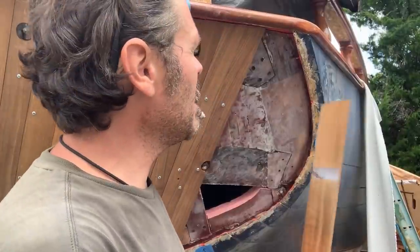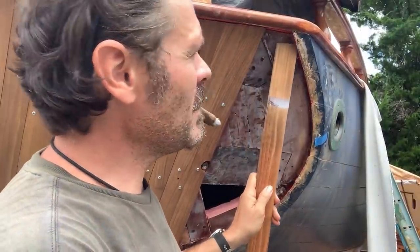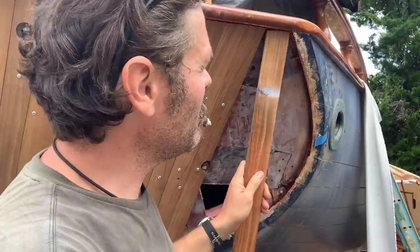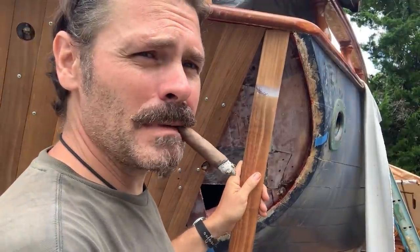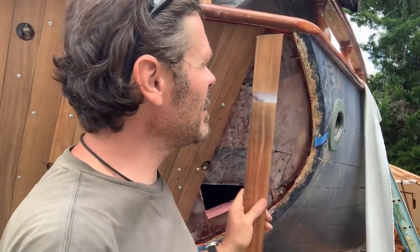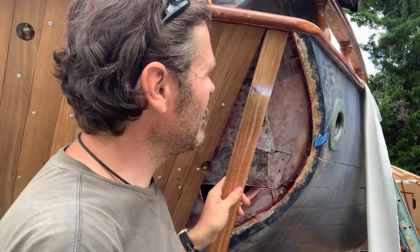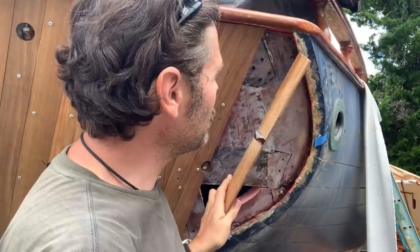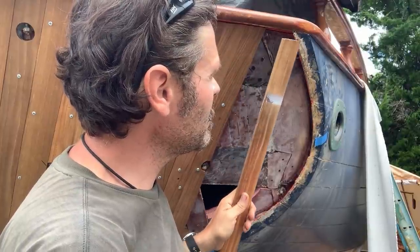So we need to figure out both of these angles, right? You've got to remember though, they're going to be different bevels. This one has a bevel, the upper one's got a bevel, and then the side one here has a bevel. It's going to be fairly straightforward though, honestly. All we need to do is get this bevel figured out, right? And then get this one figured out, right? And then just from the edge of that other plank, measure the distance to this, and then we're done.